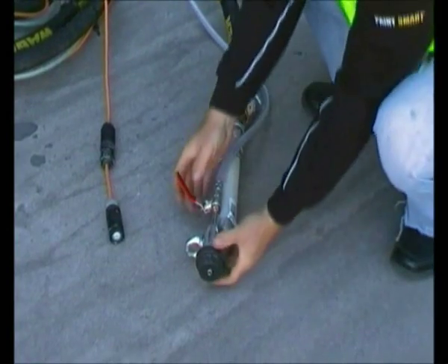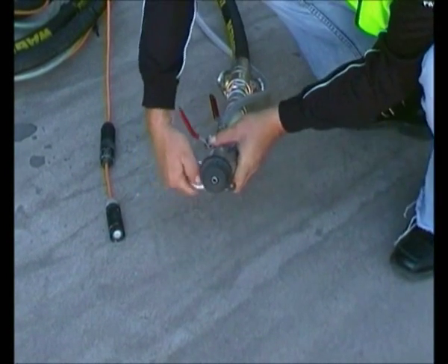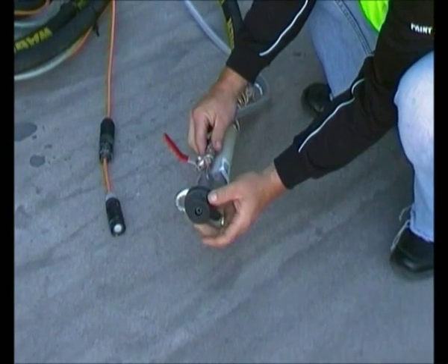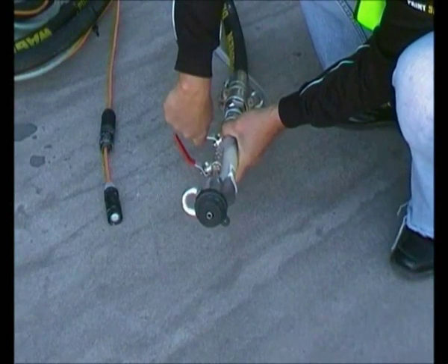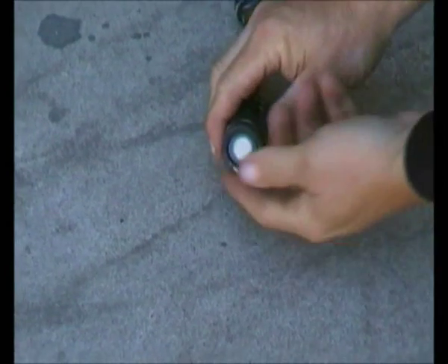Adjust the air flow through the lance by moving this lever. To adjust the spray pattern, move the tube in and out of the lance and secure the ring. To engage the product, move this ball valve. To start the machine, press this render lance switch.